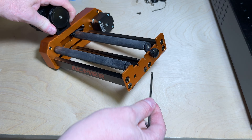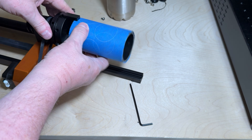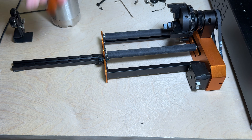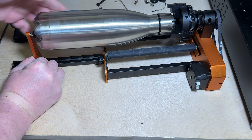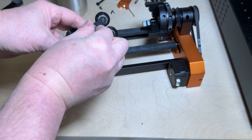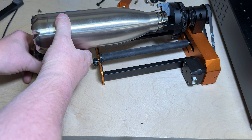If it's a heavy item, I can remove the extrusion from the center and stick it on the end so it hangs out beyond the work — that means I can put very heavy items on there without tipping the rotary over. Or I can move the extrusion to the other end and use the end roller. Or I can use the double rollers by taking the extrusion off completely and laying it out further away from the rotary itself — it's completely detached and I can adjust the height.